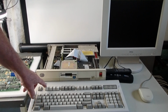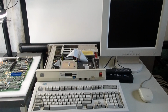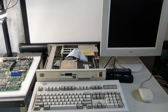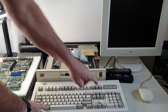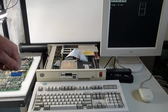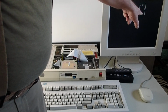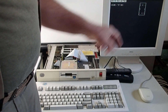I'm going to press the F1 key again. It does another diskette seek, and then gets into a condition where that light has gone out now. I'm going to do a warm reset, which is just the Ctrl-Alt-Delete key sequence on the keyboard. Okay, we got the dual beep again, but this time we got video on the screen. And I can see that this is the later Model 30 BIOS by the square clock animation on the right hand side.